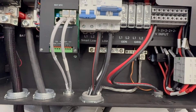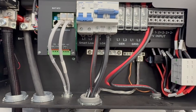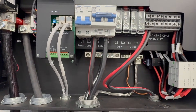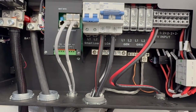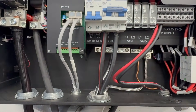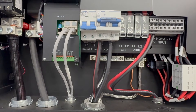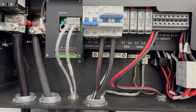The final downside of aluminum is that it cannot carry as much current as copper and has slightly higher resistance. However, if you're connecting this on your AC output, you're looking at high voltage, so you're going to have less of a voltage drop than you would on a lower voltage system. So you can definitely use it.